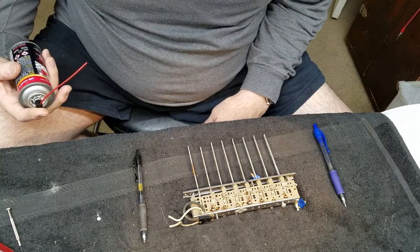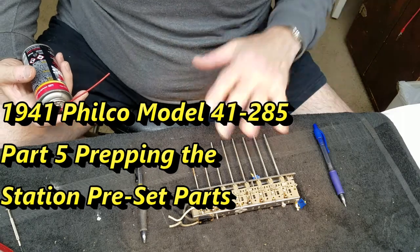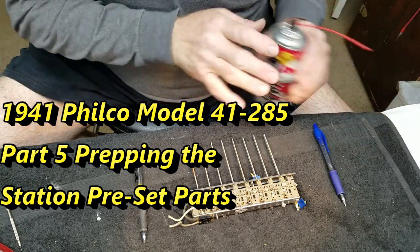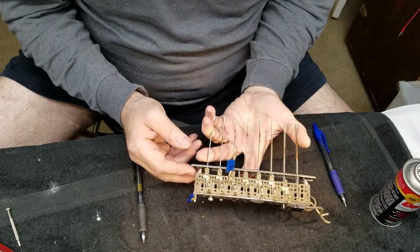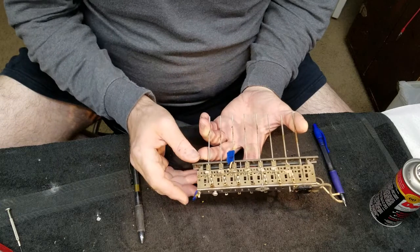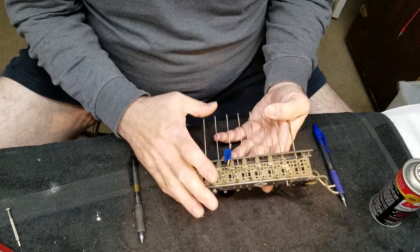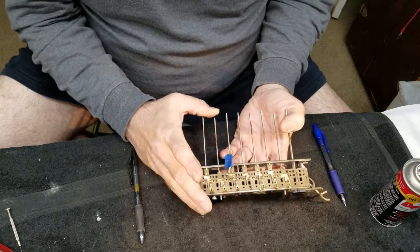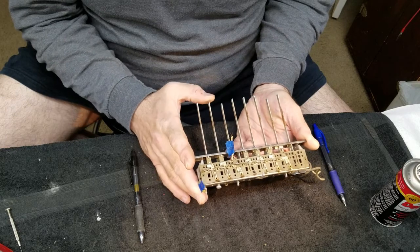While the chassis dries, I'm going to clean up this push button. I've already washed it with soap and water in the bathroom sink, so it's pretty clean dirt-wise. Now I need to get some corrosion off of these little sliding contacts. You can see how they work - these contacts slide. The push buttons are already working better since I cleaned all the grime out of them.